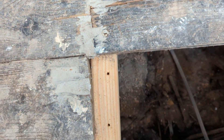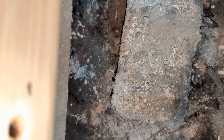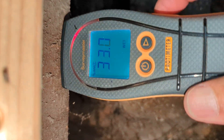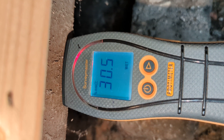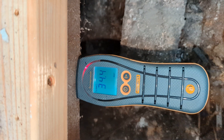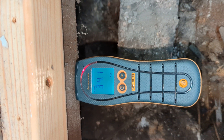So we're talking sixteen to seventeen percent on the upper surfaces. But I've said this before — it's massively important that we understand that the heaviest moisture content is going to be down at that point. Now you can see we're over thirty percent moisture content on the underside of the joist, and if I get right on the edge we're now at thirty-four percent. That's the sweet spot — it's where fungal spores can germinate.